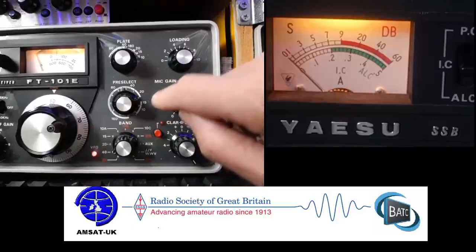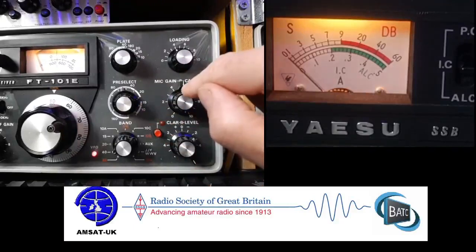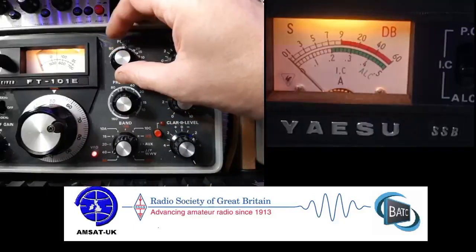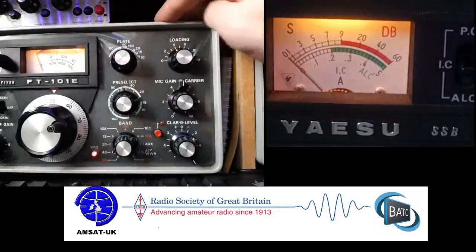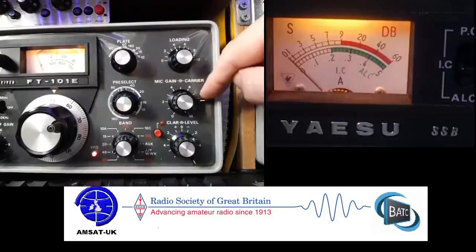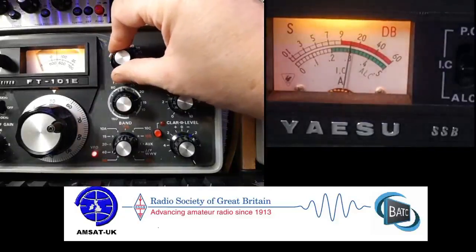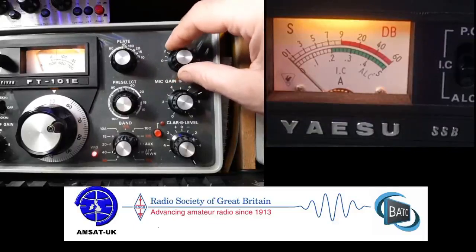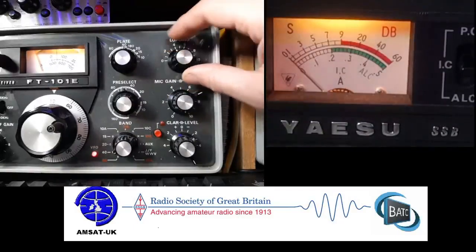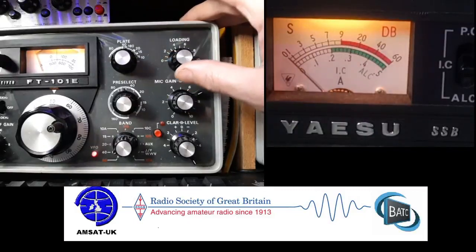Now, if you're not used to it, bring it up to three and do it again. I'm going to bring it up to five. Start at two, bring it up to five, look for the dip again — there it is. You've got the dip. You can bring it up to eight; I'll bring it up to seven. Again, look for the dip — there it is. Now you can bring up the loading as well a bit. I can't show you the SWR meter at the same time because I haven't got enough cameras, but it's giving me 105 watts at the moment. Peak up that loading to get that power out there — 105 watts.